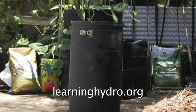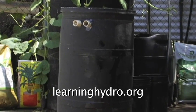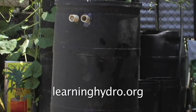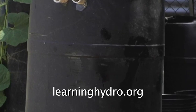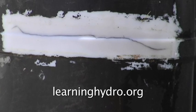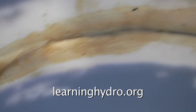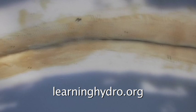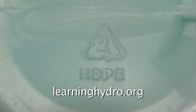This is a plastic barrel I used for an outdoor hydroponic garden. I used it for years, but when I relocated the garden, the barrel got broken in transport. I sanded off the black paint and laminated fiberglass patches on the outside and the inside. However, I did not know polyester resin will not bond to HDPE plastic.